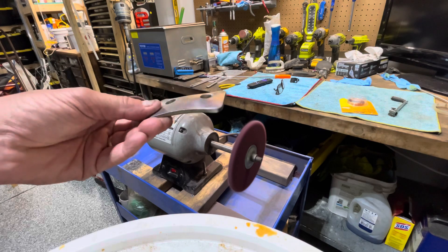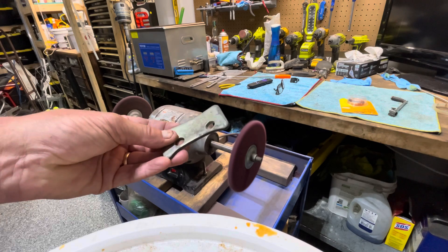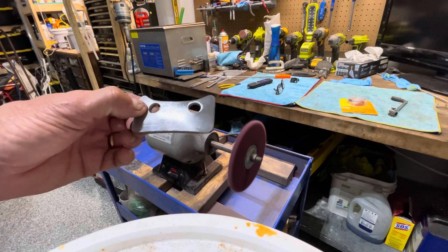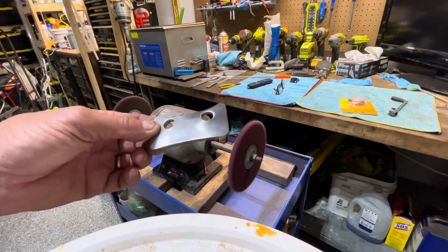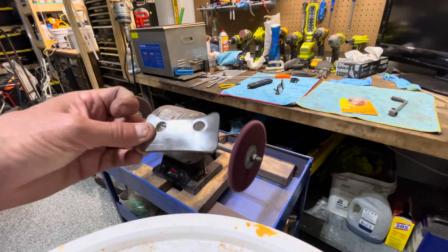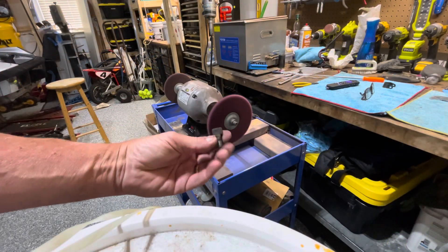See, it's just unbelievable how fast it takes it off — and it takes rust off as fast or faster. I'll probably buff some of this off, but we really don't have to because the main thing is getting it clean. The other thing I'll do is put it in a mixture of half water and half muriatic acid, and that will strip any remaining rust or plating. If you don't get all that off, you're not going to get a good final product. So this is the first stage.